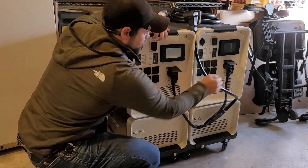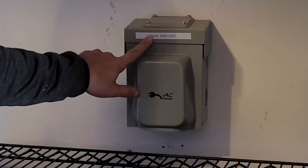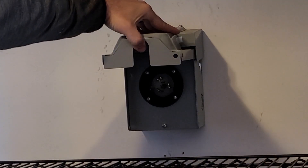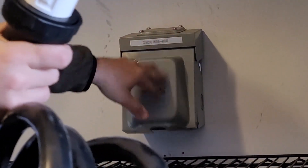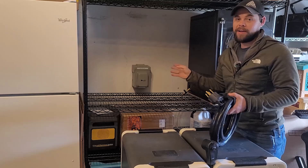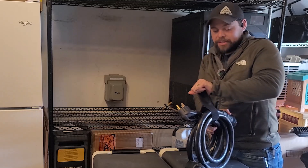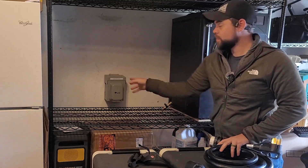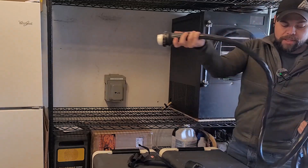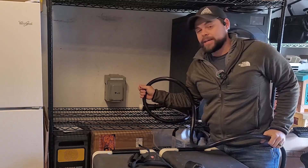I have the system completely turned off, my RV plugs in, and my NEMA 14-50R. This here is my interlock switch — a NEMA SS2-50P — and right inside I have those prongs. So the R connector connects to that. Not all interlock switches will have the same outlet. If you don't have one, I recommend an SS2-50P simply because it's much easier to upgrade your system over time. This is rated to 50 amps and I actually have four Apollos, so I'll be doing a 50 amp input eventually. Install the right interlock from the beginning.